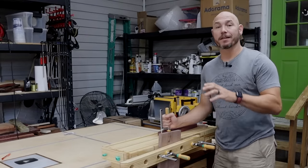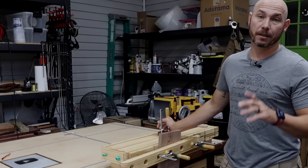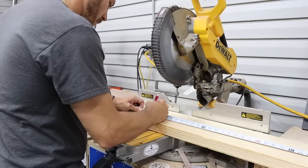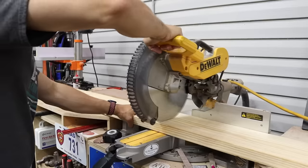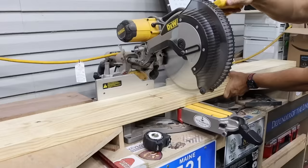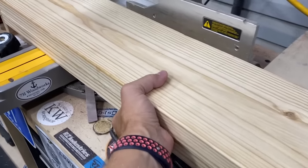This is an easy woodworking project that'll add a lot of versatility to your wood shop. I start by squaring up the end of the 2x10 — actually this is a 2x8 because I don't know how to follow his instructions, but the plans will call for a 2x10. I squared that up and then made two equal cuts, a little over 34 inches for these two pieces.